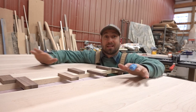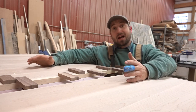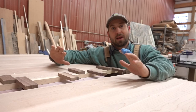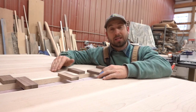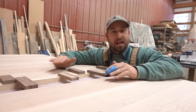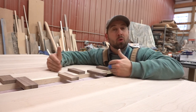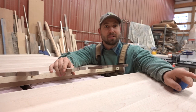What I would also do is before you do it on your tabletop, take some scrap and make sure your jig is calibrated and accurate so that you're not doing it for the very first time on your piece. But that is how you can align your leaves. This is actually a board gaming table that's got a removable top — the top is in three sections that they're able to remove. They can leave some sections on, take some sections off, but they didn't want dominoes. With the domino you can do your male part, put it in there really tight, glue that in, and then you have some variation on the other side because you just click it to the next domino setting where it's a little bit wider and you have a little more leniency in the tolerances. But with these little metal dowels, I don't have as much leniency in the brass.